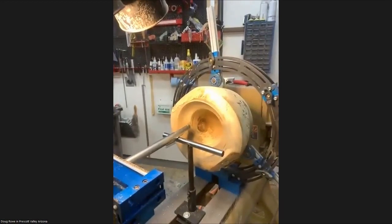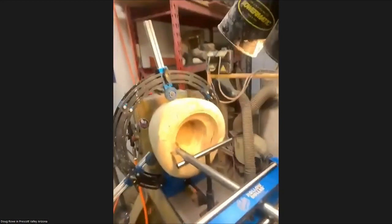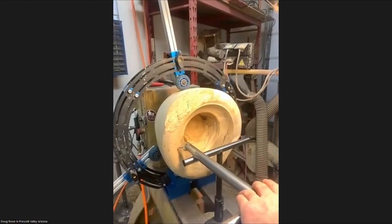Let's go. All right, well, don't go from the ridge of your hole to the actual rim. Move up to the rim and hollow to the wall, i.e. outward. Yeah, from there to the wall, and then work deeper, and from there to the wall, and then work deeper from there to the wall. And at some point you may have to widen your hole, but the point is you don't come back to the wall once you get it where it's thin, unless you're just blending previous cuts with the current one. You know what I'm saying?